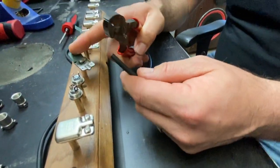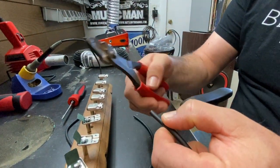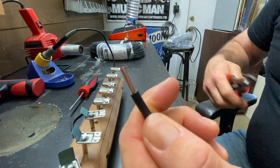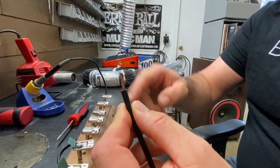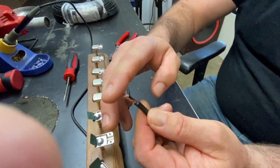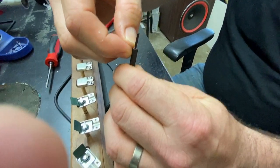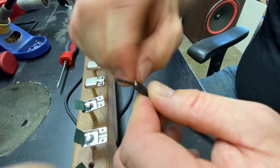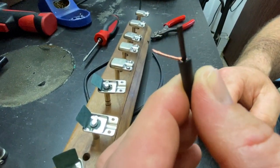The SP500s — you can see, that's the flat pancake style. You don't need to strip much off. We're going to strip the outside jacket using the number 10 gauge stripper, stripping it back about half an inch. A good set of strippers is going to cut your outside jacket nice and clean like this. One of the cool things about the Mogami cable is it's spiral bound, so it's real easy to just take your finger and peel this ground right back. Super important now is to twist this really tight — push it as far down as you can and twist it really, really tightly.